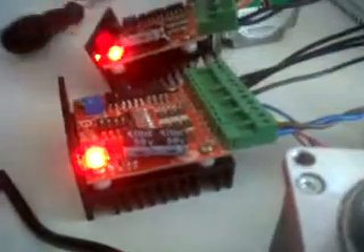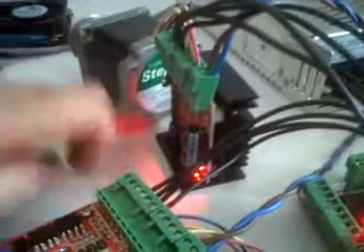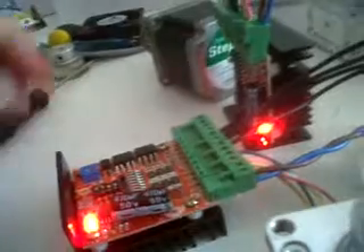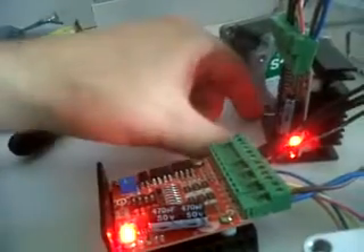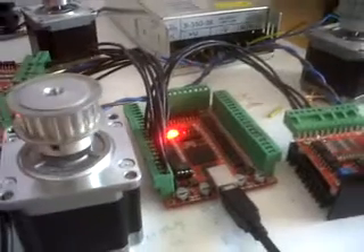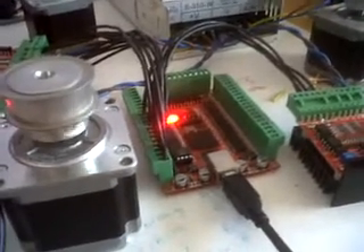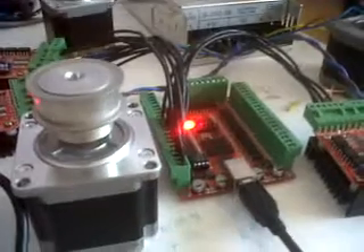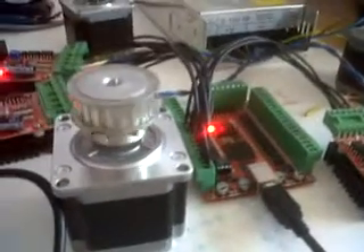When they're in your box you stand them up and the connector's just pushing from the top. You could run a fan on the back — is that bolt spacing the same as an off-the-shelf fan? Can you run three 12 volt fans in series and feed them 36 volts? I don't know, I'm not an electronics guru. This is the stuff that's available and cheap. Do the comparison — is that breakout board and three drivers at £90 delivered similar in price to the TB6560 chip with a parallel connector at £90? The beauty here is just any old laptop, USB.